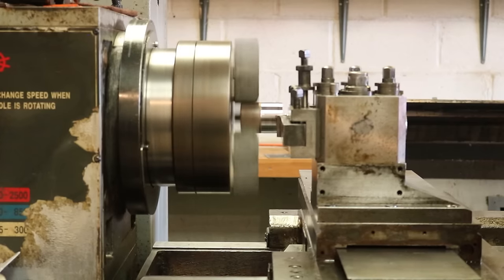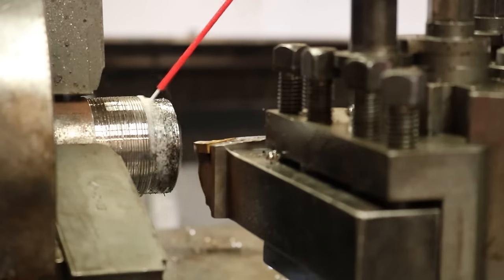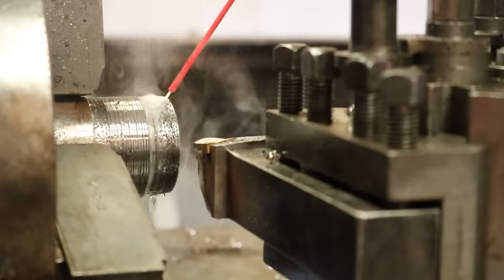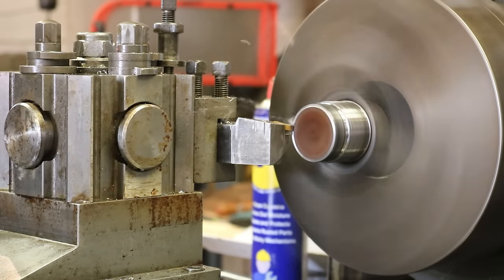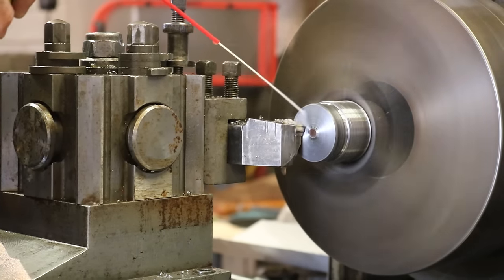Now this seemed to be getting way too hot, with a pretty poor surface finish. It also managed to pull the stock out of the chuck, so something was a bit off. You can see that the chisel seems to be digging into the stock, which is why we're getting this almost thread-like pattern on the surface. On the facing part, it's clear to see why. The tool is about 10mm above the centre line. So luckily, this was just my fault, not the lathe's.